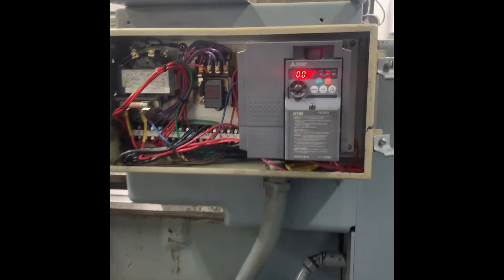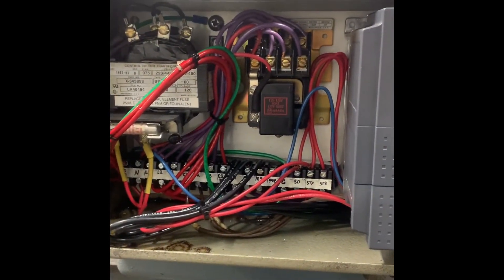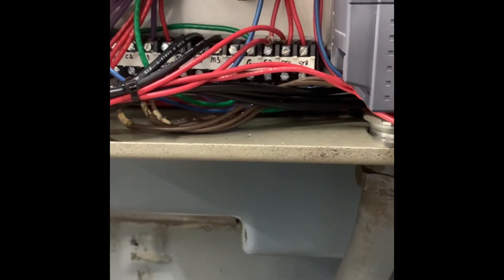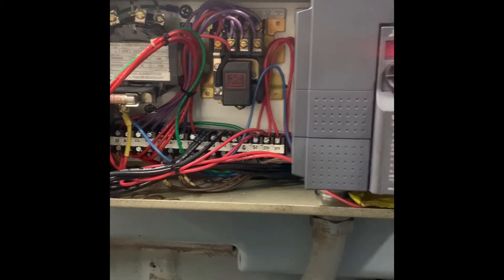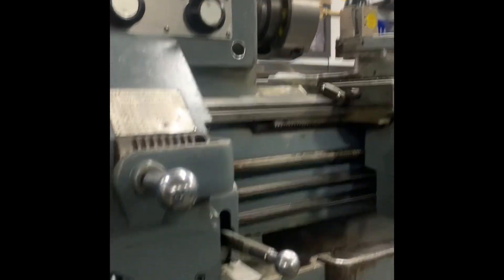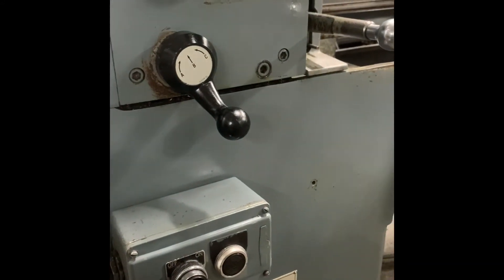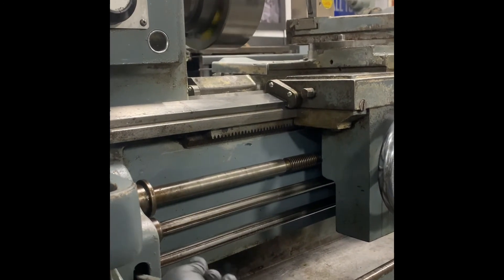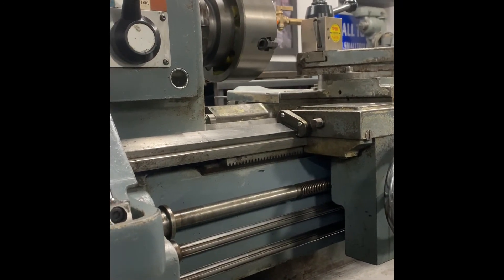Here we have the electrical system. We retained a contactor for coolant, we have control voltage to control the contactor, everything's labeled out on the terminal strip at the bottom. It's a little crowded but you can still get to everything. The panel's original, which is kind of nice. We have a Mitsubishi D700 VFD — you can run it on single phase if you'd like — and a little start-stop switch on the side. If you come around to the front, you see we have that jog button we talked about to make it easier to mesh the gears when they're not going in. You have to oscillate the spindle — you can do it right there, right down by your feed. Then you have the coolant switch. The on-off handle works just the same as it did when it was manual, only now it runs through the VFD and through the IO board on the VFD.